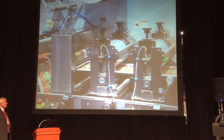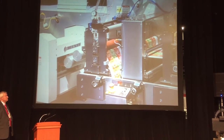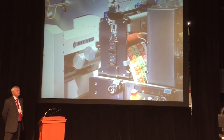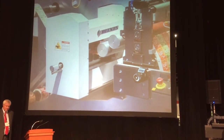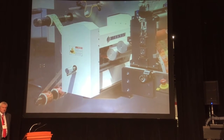We're going to move on to Station 7. At the end, that is another nip for tension. We peel the matrix, and then you can see there's a Delta slitter module — it's an automatic shear slitter, so you can automatically set your knives. You can have that saved with the recipe for different jobs, and then we're rewinding the finished labels.